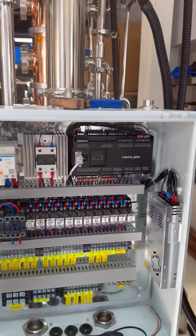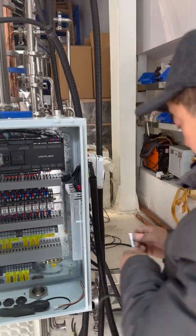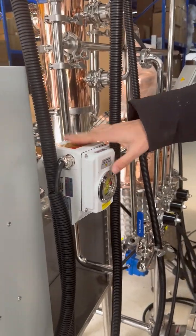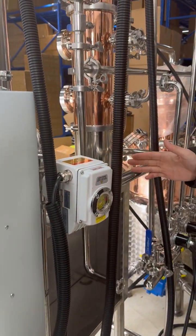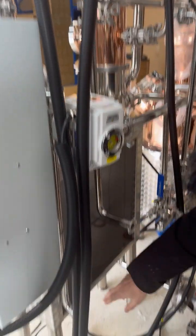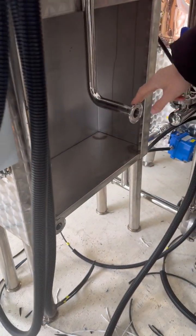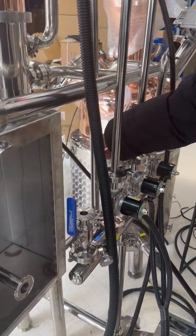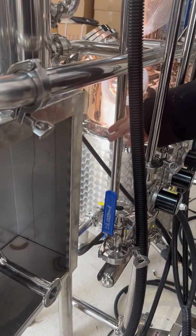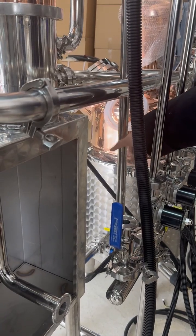And from the back we will see. This is the inlet — water inlet, the condenser water inlet. You should use your CT water from here, the inlet 1. Here is the inlet 2, and this one should be connected to your CT outlet. This one is the warm CT water outlet.